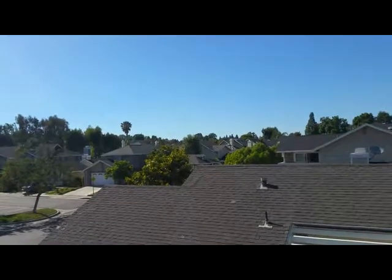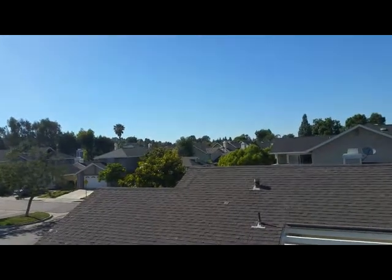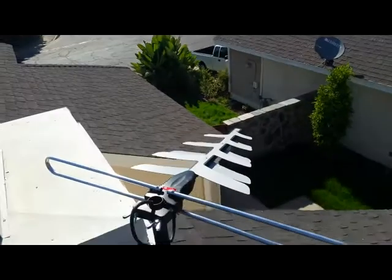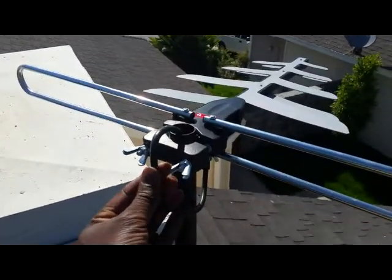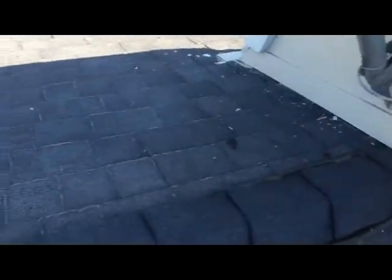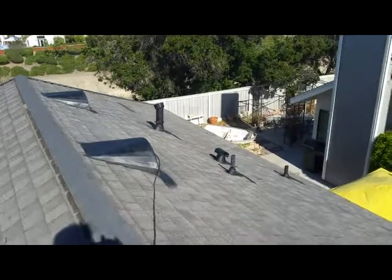Sorry, that's 323 degrees off of true north. I think we're also hitting Mount Wilson. The coax is connected here — quad-shielded coax cable, fishing down through the mast, down through the bottom, along the top of the chimney. I just gently tacked it to the roof to keep the wind from whipping it around, then it goes through the vent over there.